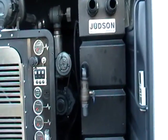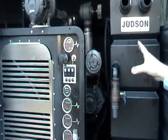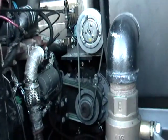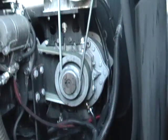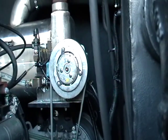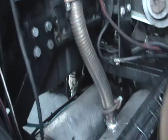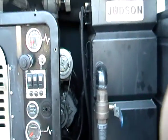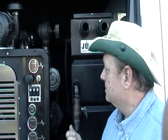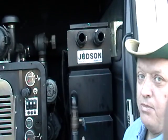The major changes are in the very back. You can see the access here — how much easier it is to get to the engine, the belts, and the pressure pump. You could not get to the pressure pump at all before — now it's just right there in the open. The unit is now strictly propane heated, so the engine does not need to be running at high RPMs to produce heat. The parts were no longer available, so that was part of the reason for the change.